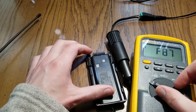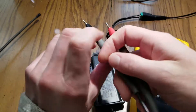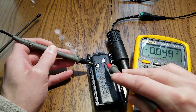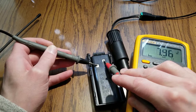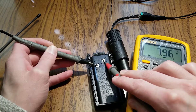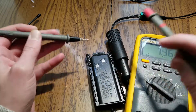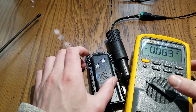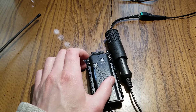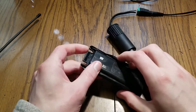I checked the voltage at the output to make sure it's somewhere around 8 volts, which is what the battery pack would give you. I'm getting about 8 volts - the battery pack will give you anywhere from about 7.4 to 8.4 volts or thereabouts, since it's two lithium-ion cells in series. The output looks good.